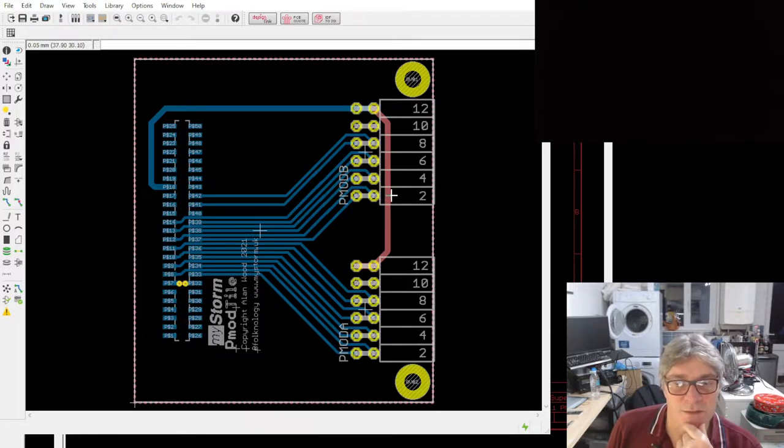Of course, what you've got to remember is with that configuration, which I think will be default for me, the PMOD will be flipped in terms of the IOs on top and bottom. The power and the ground are the same, because they're parallel. But when it comes to the PCF file or the MYGEN board file, we need to appropriately set those so we get them the right way around. That's just an issue with the board file or the PCF file, not a hardware issue.